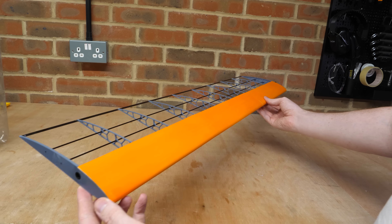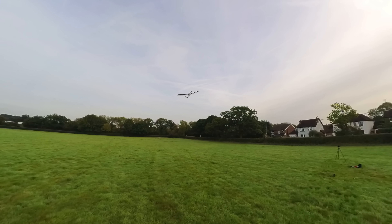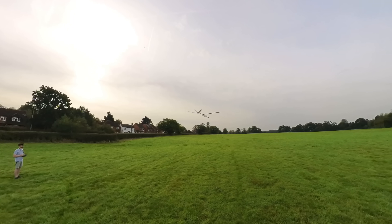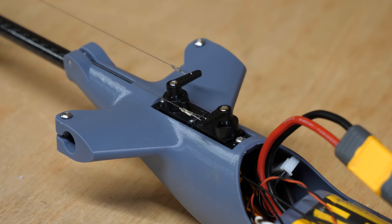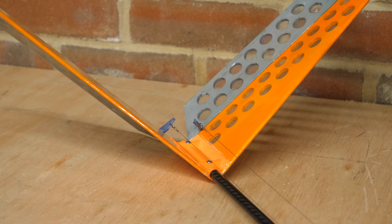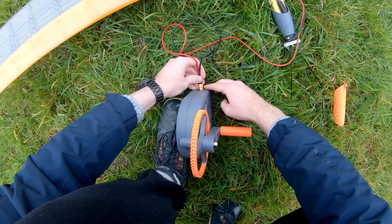For the wings and tail of the plane, I decided to reuse what I built for my previous air-powered plane project, as they are lightweight, efficient, and took a while to build — which saves cost and time. These simply clamp into the new fuselage and the cables can be attached for the tail control. Finally, I attached a folding propeller to the motor to prevent any damage when landing. And it's ready for a test.